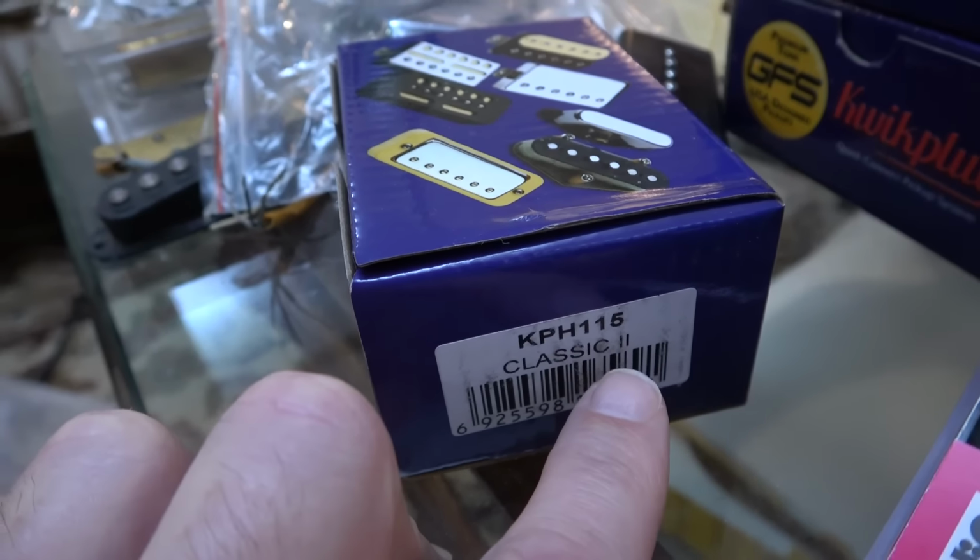Okay, so there's the laser etch. And like I said, it looks good on this card, but in order to get that on the headstock, I'm gonna have to up the contrast for sure. The fact that this is already finished is the problem, because it has to get through the finish and then into the wood, and the finish has a tendency to burn.